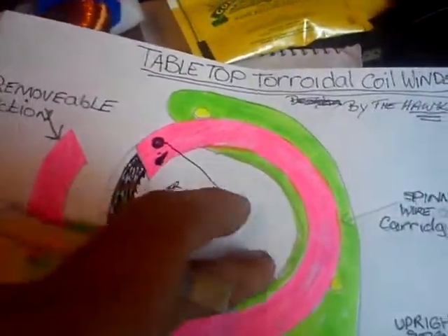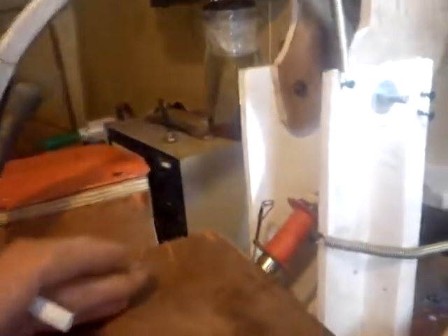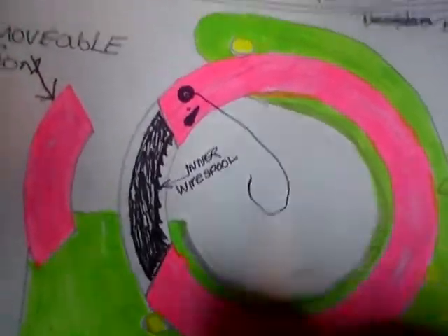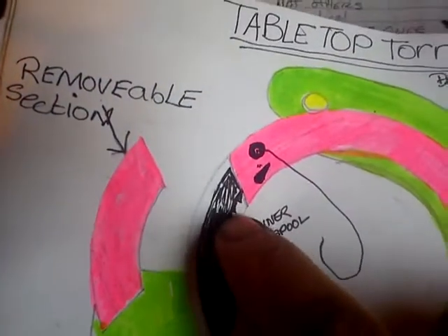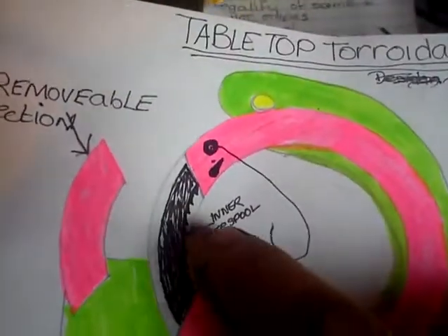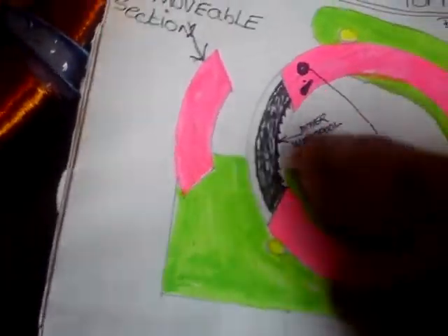But instead of the spool being in the center, you're going to have another ring running on the inside of this. This is going to be scaled down to tabletop size. The ring that runs in here will need teeth and be on a small ratchet — maybe a few of these around here, the same sort of thing as you have in a socket wrench, the way that ratchets work. This will give enough tension to keep the wire from all spooling out, and secondly it will lock this in place when it's rotating in reverse for filling the bobbin with wire. So you fill all your wire onto this, and this will only go one way, and the wire will come out here and feed around in the winder.